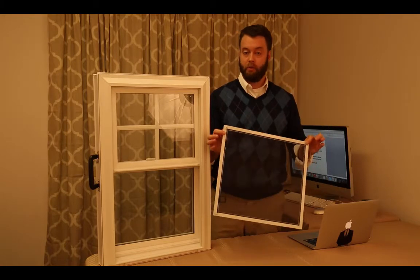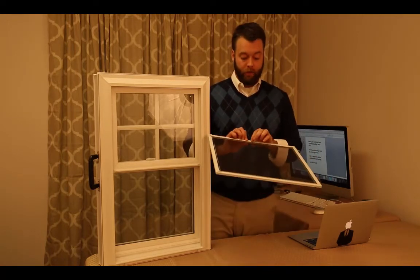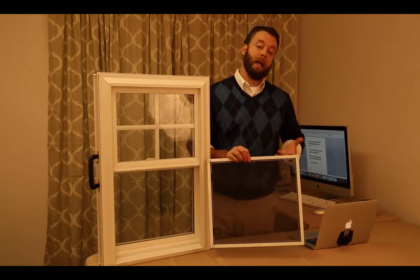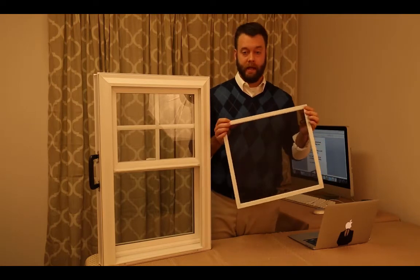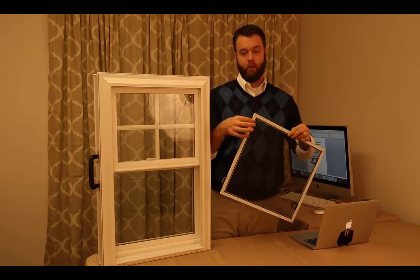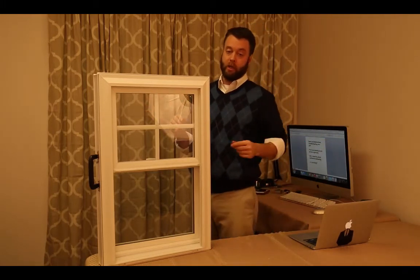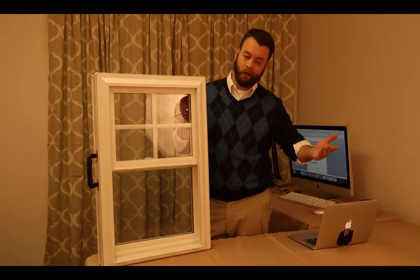I would probably not buy this window just because of that screen — and we haven't even gotten to all the drawbacks. The spline — the rubber part that holds the screen into the frame — is on the outside. When you have that spline sitting out in the summer for five or ten summers getting baked in the sun, it's going to get dried out, crack, and fail. You'll get a wiggly screen and have to waste a Sunday rescreening. All other double-hung windows come with screens where the spline faces the inside, protecting it from the sun — this window does not. You've also got external corner keys, white vinyl pieces joining the screen frame. I would bet the cost difference between a cheap screen and a nice screen is less than a dollar, but they use the cheap screen to justify this as their lower-end model.